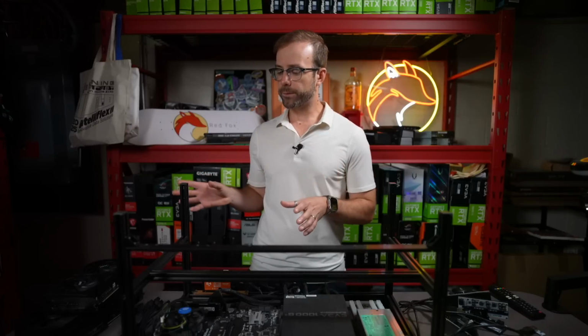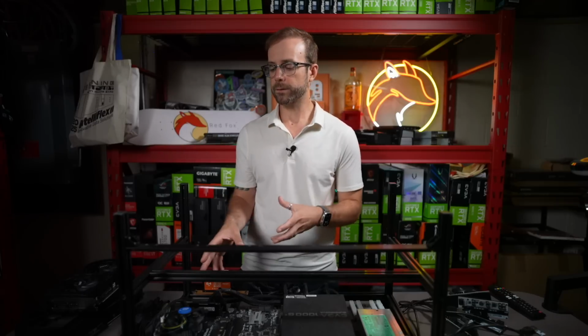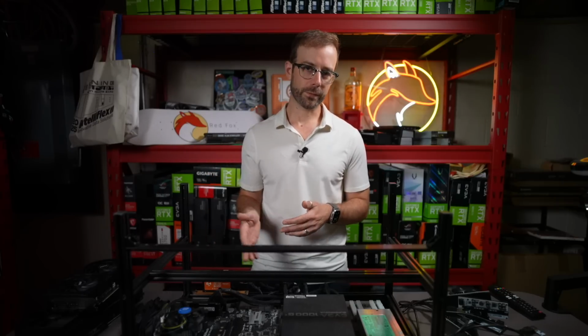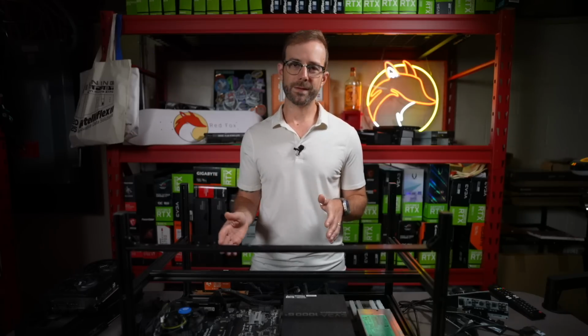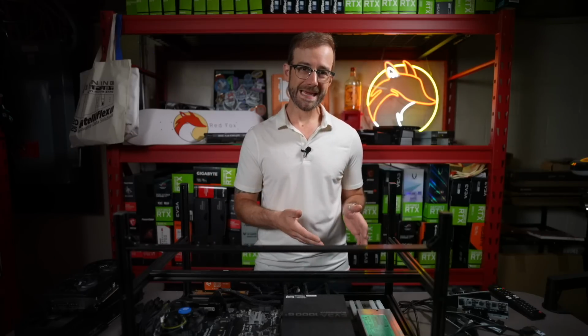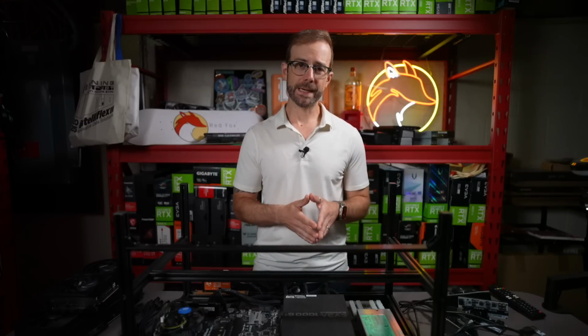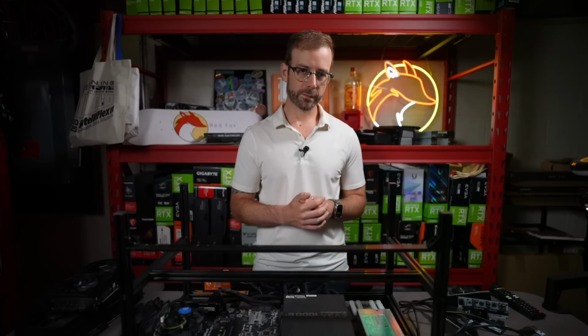So I can put both of those on the ATX power supply, have plenty of connections, and that can also give some headroom for the motherboard and the processor, which are probably only going to take like 50, maybe 100 watts maximum. And then what I'm going to do is throw the 5080, which is 360 watts, along with the 5090, which is 575 watts, onto the HP server power supply.